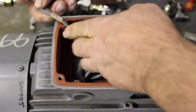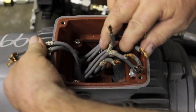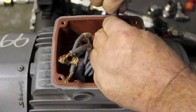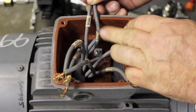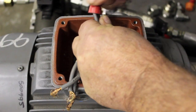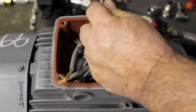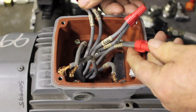For high voltage 460V wiring: take wire 1 and set it aside, find wire 2 or 3 and get them out of the way. Then find 6 and 9 and wire them together with a wire nut. Find 8 and 5 and wire those together with a wire nut. Then 7 and 4 — that's your last combination. Now you have 1, 2, and 3 going to L1, L2, and L3. If your motor is going in the wrong direction for the pump, reverse any 2 of the 3 leads — L1, L2, or L3. And that's 9-wire 460 wiring.